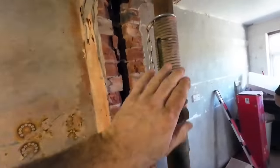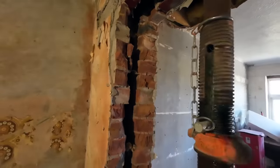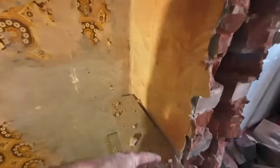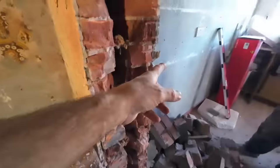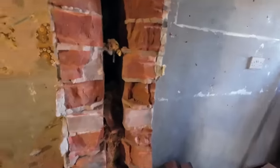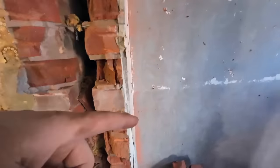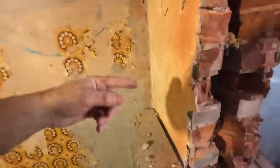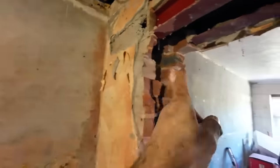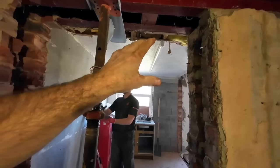Yeah. Alex has got this in here. Yeah. This one still goes through, doesn't it? We've discovered this steel sits on here 400, but the extension is 150 narrower? 100, I think. That's 300. So that's further back than that. So we've got our 300 seat in there, but when you get on this side in the original house, it's 400, so it's 100 mil different. So hopefully that's going to go into the cavity on the extension part. So the extension part is propped.